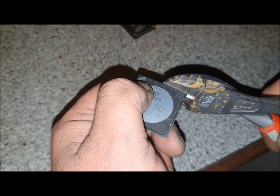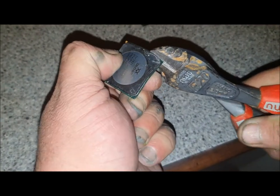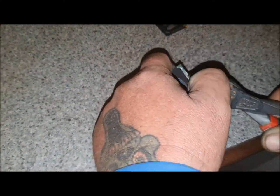If the ceramic happens to crack, you want to make sure you get the cracked parts off as well, because that's where the gold is. Sometimes they crack, especially these big ones. And then you can go a bit further up once you've got it started to free it in the middle. This is all cracked on the corners — I'll get that in a minute. These big ones are a little bit fussy. So now that it's starting to crack loose, you can pry it off.